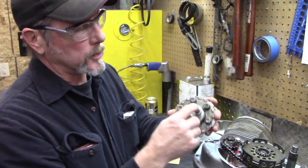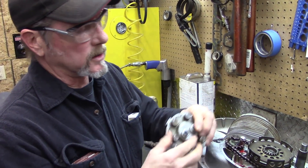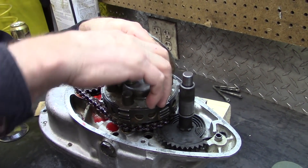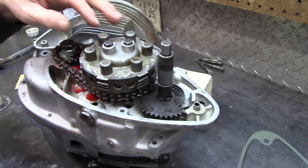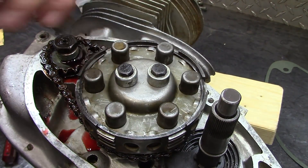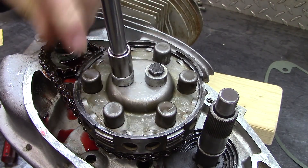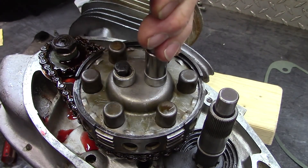What you've got to come up with is two little bolts and a stack of washers — just these two pieces. It's squeezing this together. Now you're going to put this thing in. The springs are compressed. I don't think we got enough — we're going to have to compress it some more. You've got to get a snap ring in here, and it's as far down as this is going to go. After the snap ring is engaged in this groove, now you can release the pressure. All these springs are going to want to push up against that snap ring and hopefully it never comes out.